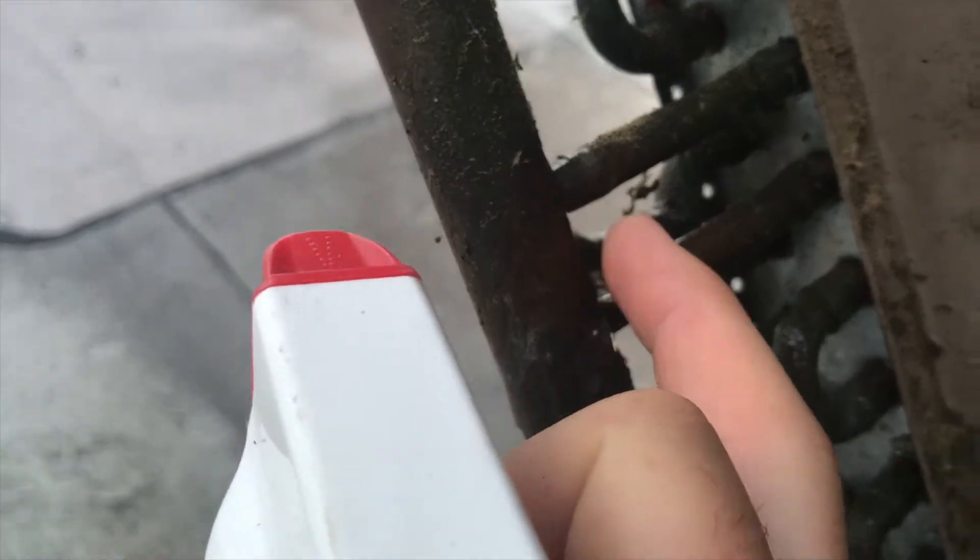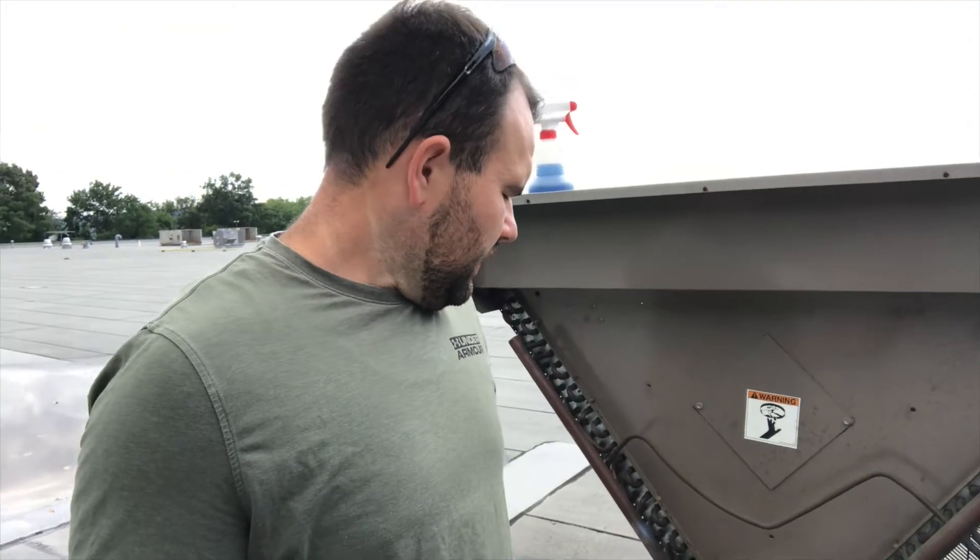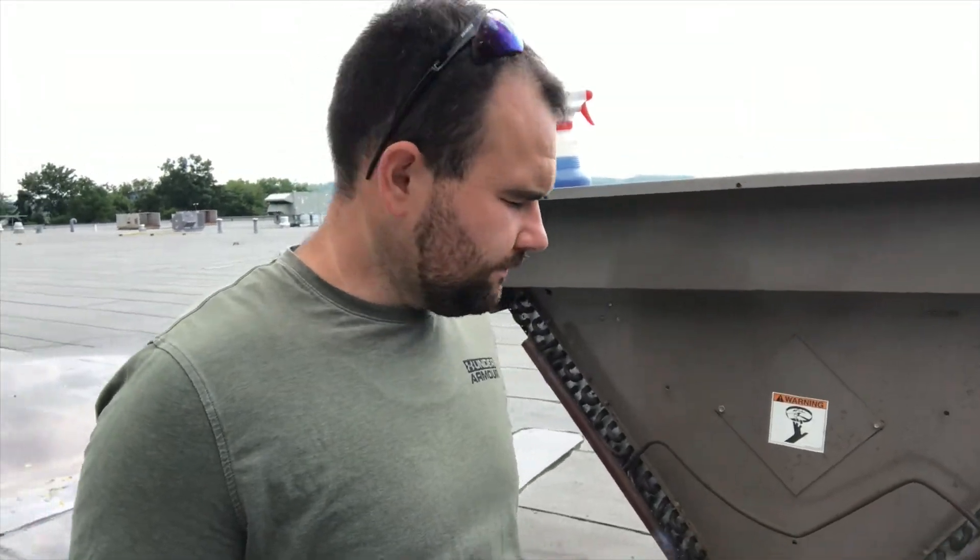Right there on the bottom of that fitting. Now that we've got the leak fixed, I pumped it up to almost 300 psi of nitrogen, soap-bubbled everything I worked on, and we're in good shape — no more leaks present. Checked the filter dryer as well, and all the connections over there are good.